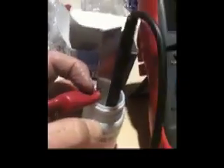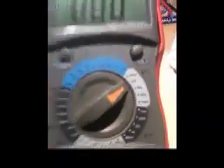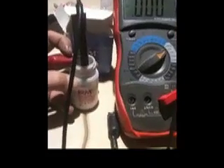With a magnesium electrode and the negative of the multimeter buried in the zinc oxide with no form of liquid in it, we register zero voltage in the microvolt scale on this multimeter. However, zinc oxide, due to a piezoelectric effect, can function very nicely as an accelerometer.